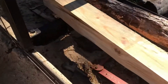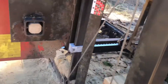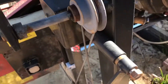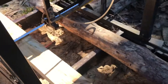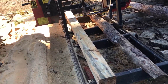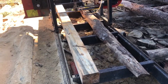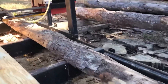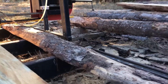I'm sawing half-inch thin boards for sheathing, so when I make that fourth cut I set my block for the dimension I want instead of just eyeballing it. I've been instructing my father-in-law on running the sawmill — I'm by no means an expert — but I told him that running this thing effectively is all about constantly thinking about what you're going to do with that log. It's easy to just throw it on there and square it up, but if logs have even the slightest bow or bend in them you lose a lot. This scrap here came off the top — took that off and it was like, 'man, not going to get anything useful out of this log.'